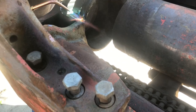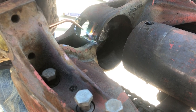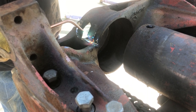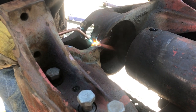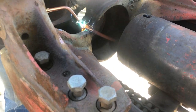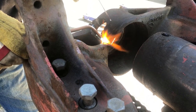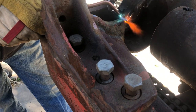So now you just heated that rod up just a little bit and then dipped it in that flux? Yeah. Oh yeah, all it takes is just a little bit of heat to stick. If you put too much heat, you'll melt your brass. See, when it's hot enough, the metal, you see that brass stick to it there where it melted?